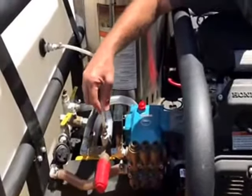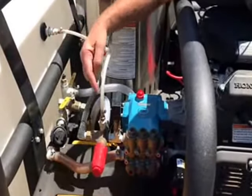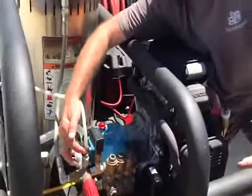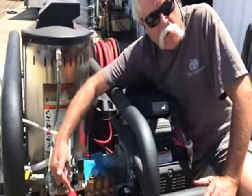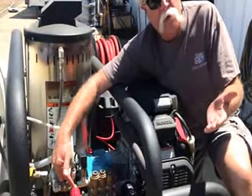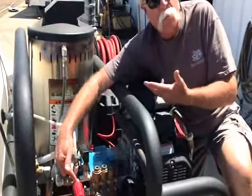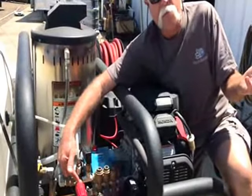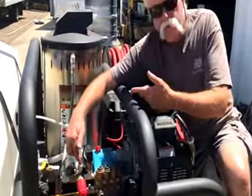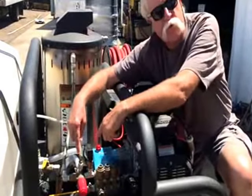This has an easy start valve, which is plumbed back to the tank by itself, but this is your first suspect when something goes wrong with these things for pressure. This is the wimpiest component in the entire system. If we'd have just used an unloader that was a reduced bypass pressure unloader, it would have overcome that. To start the engine without creating a bunch of back pressure, you can accommodate that with a flow-actuated unloader valve or a couple of other options. But using an easy start valve adds the wimpiest component that's ever been used on a pressure washer, so it's your first suspect when they fail.